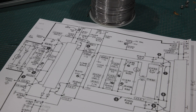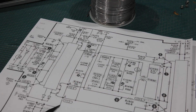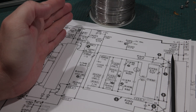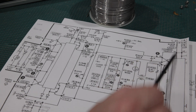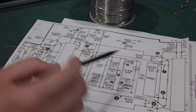The signaling and the balance are important between U1350 and U1450. U1350 handles the first signal amplification stage. U1450 handles signal and positioning — the position control gets picked up after U1450 and gets injected to bias the DC level for the next stage based on positioning. So this should be as close to balanced as it can get, hence DC balance.